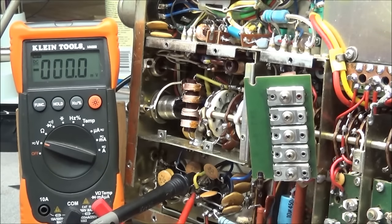Power supplied to the radio, and we're measuring zero voltage across our R12 shunt resistor. So that's a good indication our tubes are not running crazy, so we don't have to worry about our tubes going into thermal nuclear meltdown at this time. So that looks great.